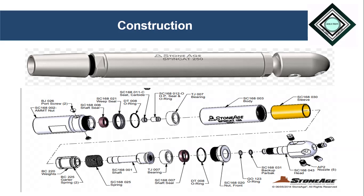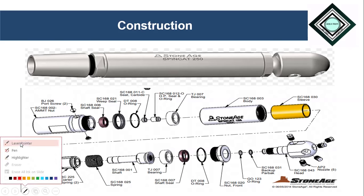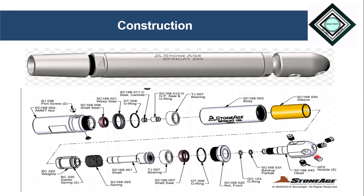After watching the video, we can easily understand the construction of a usually used SpinCat. All the detailed parts of the SpinCat are shown, but we will see only the major parts. The first major part is the inlet nut, then the SpinCat body, the SpinCat head, and in the head the jets are installed through which the fluid at high pressure passes out. Inside the body there is a shaft which is supported by two bearings. So the five major parts to remember are: inlet nut, body, head, shaft, and jets.